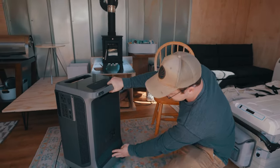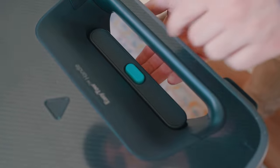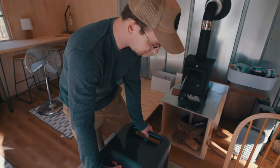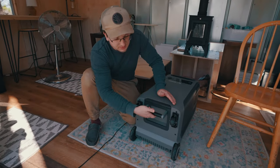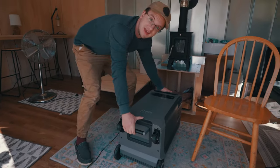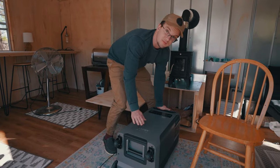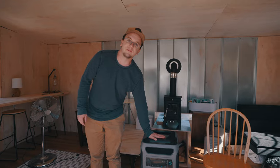On the power output side, there are 120-volt and 240-volt ports — you could plug in a washing machine or stove, your biggest appliances, directly into the larger ports. Most of what we'll be doing in the micro cabin is standard 120-volt wall sockets. There are overcharge protection breakers that can be reset if needed. The battery pack is charged by the solar panels and the inverter gives AC power — that's why these are called solar generators. There's a handle that releases to make it function like a dolly for moving it, which is useful since this weighs just over 130 pounds and delivers 6,000 watts of power and 3.8 kilowatt hours of capacity.